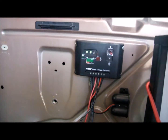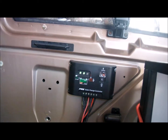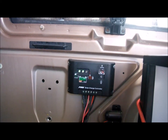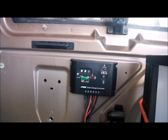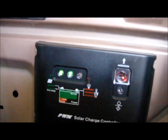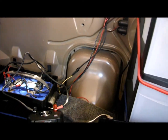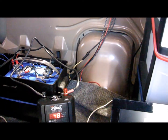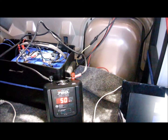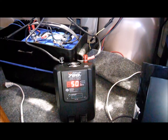See how it's blinking right now? When I turn on the compressor, it's going to stop blinking because running the compressor will use more power than the sun is providing. Right now I'm keeping up with the sun. See how it stopped blinking? That's because 252 watts is way more than the roughly 100 watts my solar panels are producing — that's why it stopped blinking.